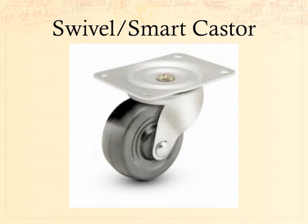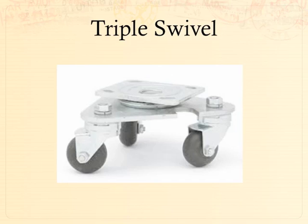A lot of times boxes end up with four smart casters, and those can actually be a little bit more difficult to steer. The triple swivel has three small swivel casters attached to one triangle hardware piece, with another swivel mounting hardware on top. This is typically used for much heavier pieces of scenery or equipment — it spreads the load out so it's not all on one caster. In essence, with four triple swivels you have 12 wheels distributing the total weight of whatever you're rolling around.